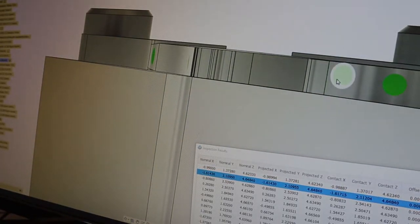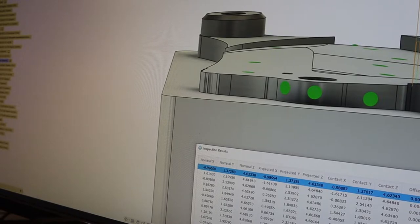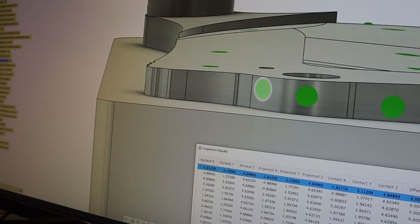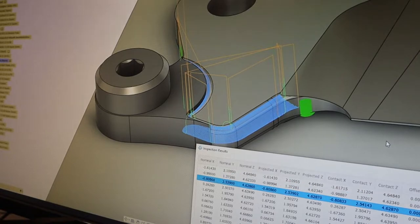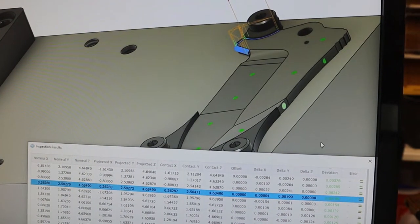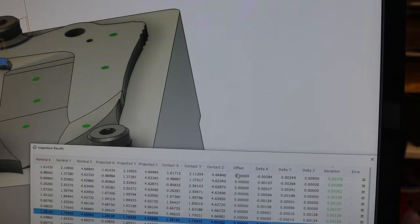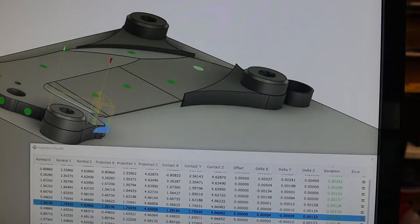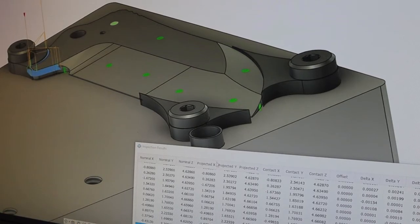That point on the back is quite a bit of deviation. That's the worst one — 3.7. Then there's one at 2.85, then one at 2.42. What I'm seeing is the worst deviated ones are on the outside contour of the model. Armed with that knowledge, we are going to rerun a contour tool path that basically recuts the outside and see if we can get better results.